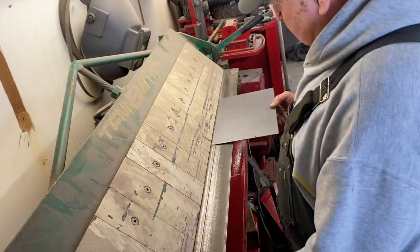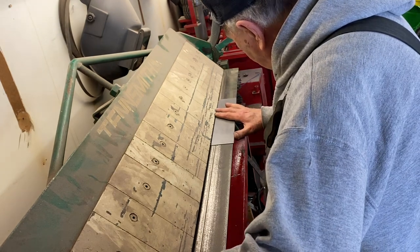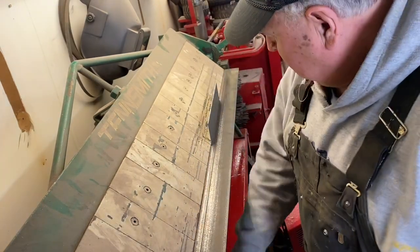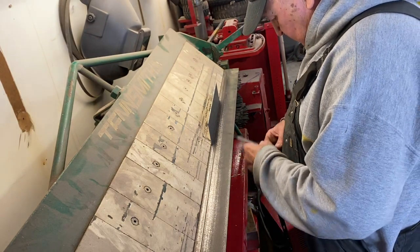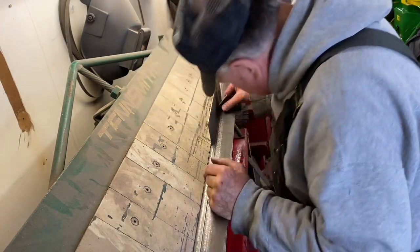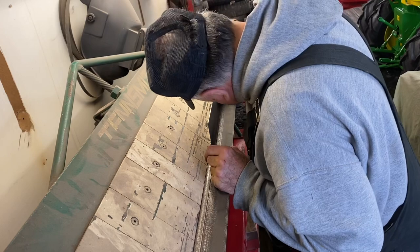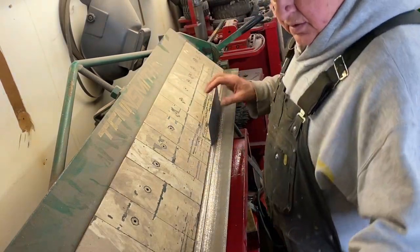I'll bend this one the same way. Put it in here, line it up, and bring it up. Right there. You see how close we are. I actually went a 1/16 too far, so I'm going to pull back on it a 1/16 of an inch, and there it is. This end here is perfect. So now I'll spin it around,